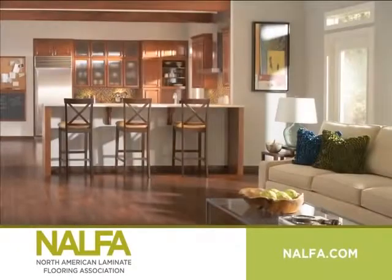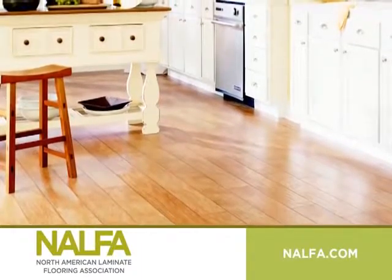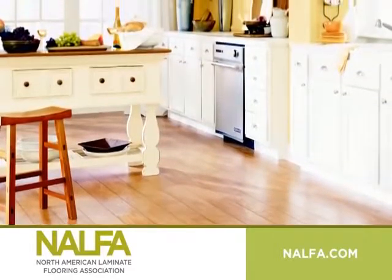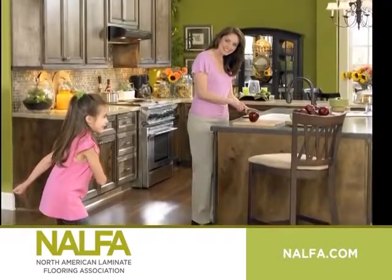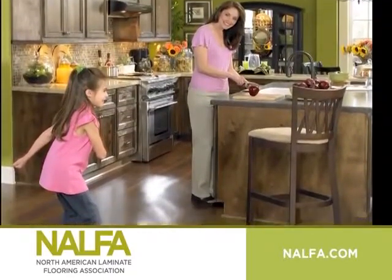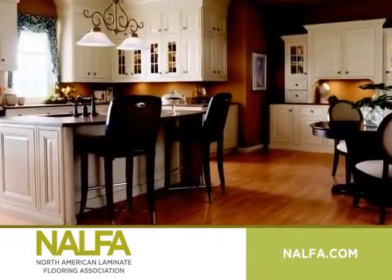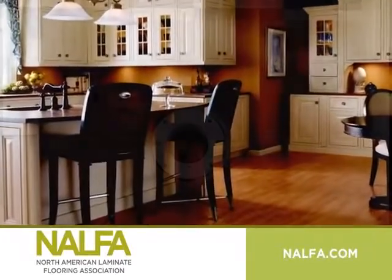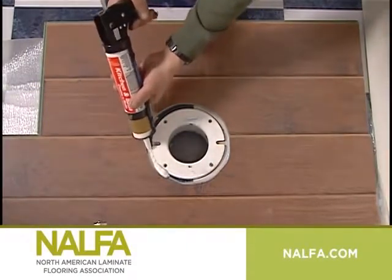Most laminate flooring is resistant to water and may be installed in kitchens, bathrooms, and laundry rooms. However, it is very important to prevent water or moisture from seeping under flooring. In kitchens, bathrooms, and laundry rooms, fill all expansion and transition molding spaces subject to moisture or plumbing leaks — such as in front of sinks, toilets, dishwashers, and around the refrigerator — with moisture resistant 100% silicone sealant. Toilets must be removed and the perimeter of the flange and pipes sealed after installing laminate flooring.